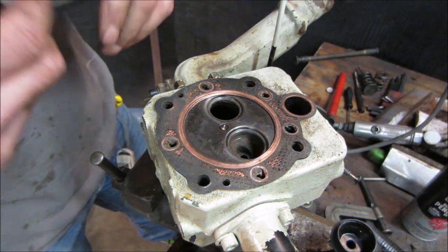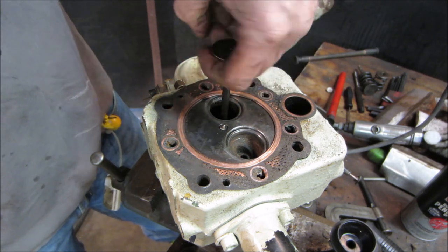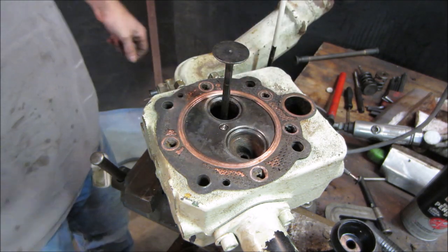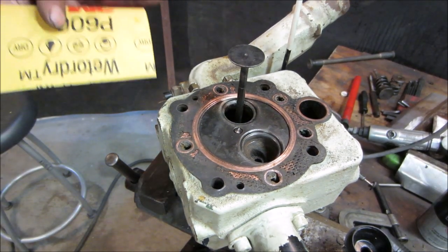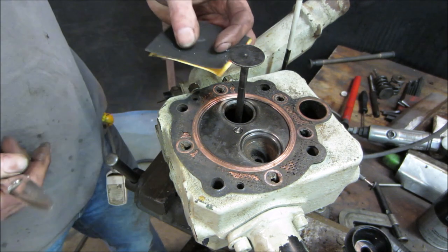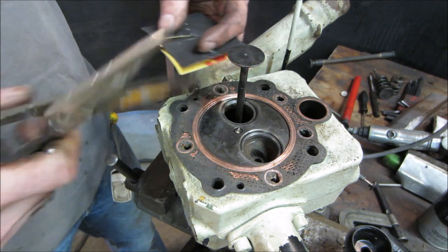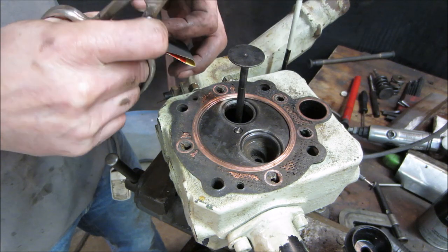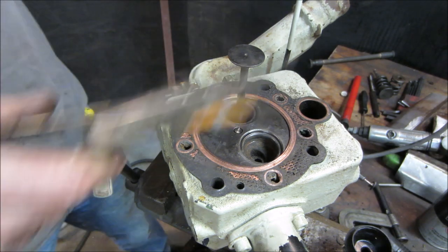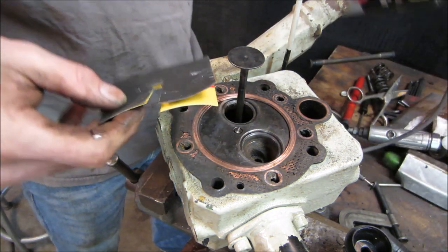like wet sandpaper. We're gonna go wrap it around the valve and do a little towel trick and try to work that sandpaper, have it kind of work on that seat and clean up some of that surface. This is 600 grit. Let's start with that. And you're gonna want to make it so we can get around the valve. Some lube.